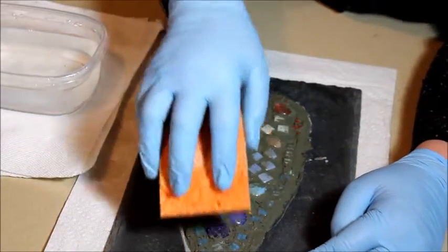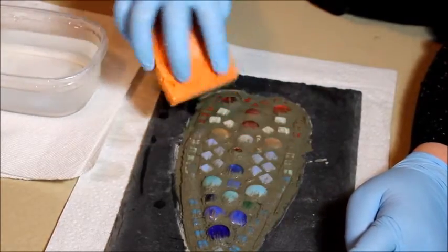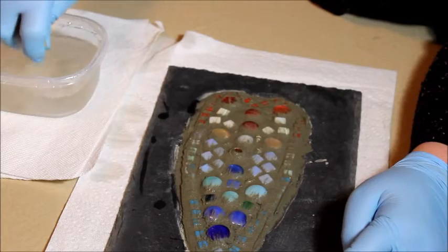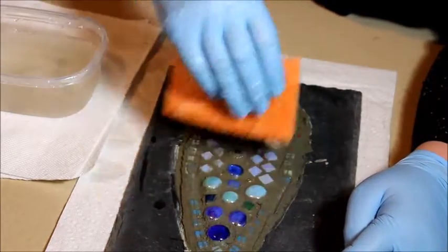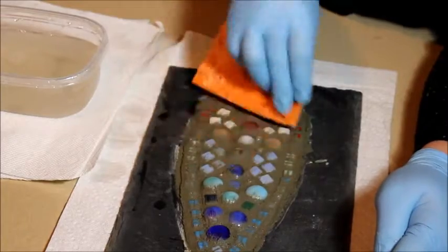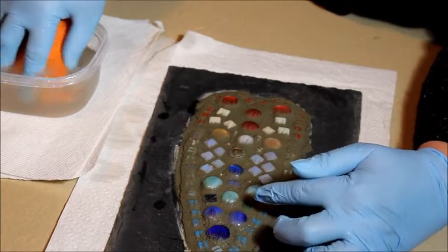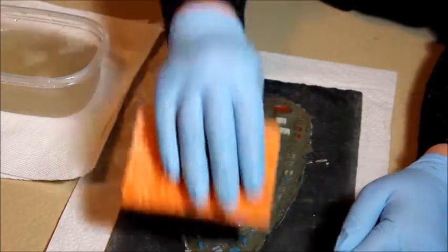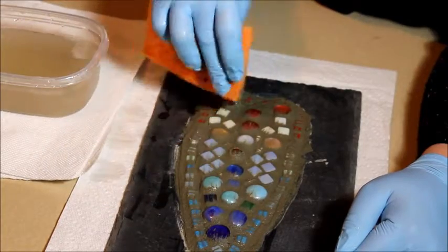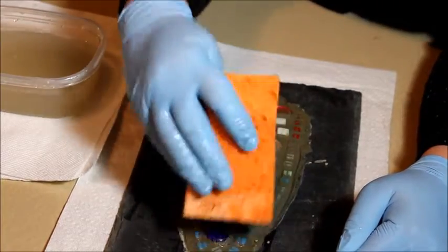You don't want to soak it down like a pouring rain, but you want to go over the tops of the tiles and just gently remove the excess. Rinse it in some water and do it again, and just repeat this until you see all the tiles you wanted to see when you put them on. Don't get too much water in there or it will dilute the rest of the grout — you just want to take it off, not add water.